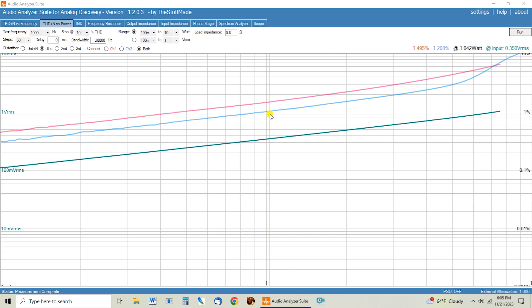Let's get into the subject of this video, which is comparing the two output transformers. The red channel is the 5K EDCOR and the blue channel is the 3.5K EDCOR. On initial looking at this, it isn't quite what I expected. The rule of thumb says higher impedance will make less power but have less distortion. Well, in this case it's making less power and it has a little more distortion. But looking at the upper right where you can see the percentages, it's approximately a quarter of a percent of distortion between the two channels — really not going to be audible. If anything, the lower impedance one has a little bit lower distortion.